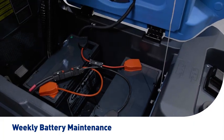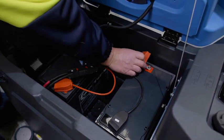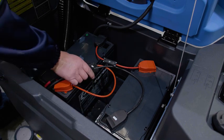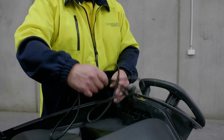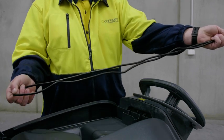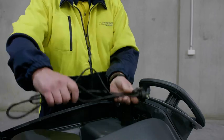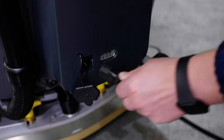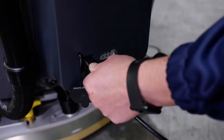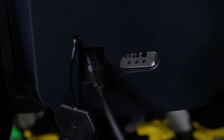Check the batteries and charge. Check that the batteries are free of corrosion and there are no visible signs of leaks. Check the power leads are in good working condition, free from wear or damage. Always ensure the AC power lead is pulled out and stored in the top compartment to avoid damaging the charger. It is important to always use the original equipment charger, which has been especially designed to recharge your Conquest scrubbing machine. Plug the Conquest Maxima 50BT in to charge overnight for a minimum of 8 hours, only when the battery indicator is showing 2 bars or less. The fully automatic charger will indicate the status of the battery pack by 3 indicator lights and will terminate when fully charged.